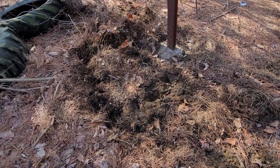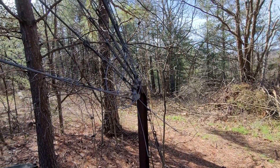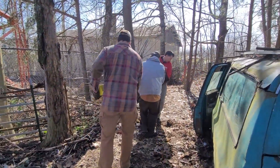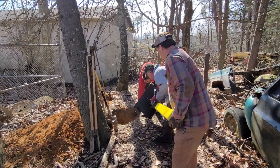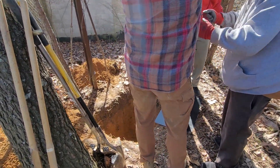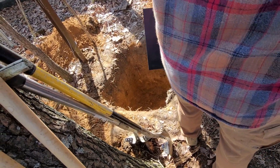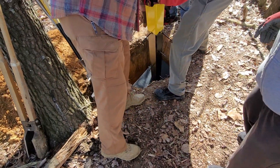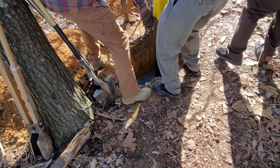This is the third post, and you can see just a little bit of concrete around the top. We've marked out what we're going to dig around that post to install the new ones. All of the guy lines — there are five or six per post — are loose, so they're not really doing their job. These posts are extremely heavy and long. I'm 6'2" and this post is taller than me. We want at least about half of it buried in the ground and then over a ton of concrete to hold it down. We're lowering it into the hole, making sure it's level and that the ring attachments at the top are pointing towards the tower — so we had to pull it back out and readjust.